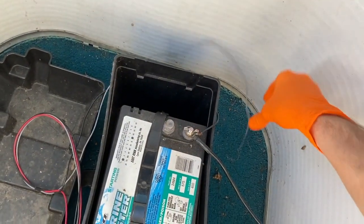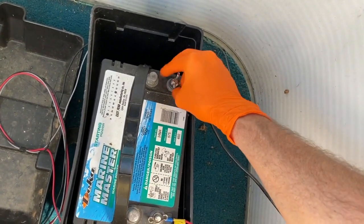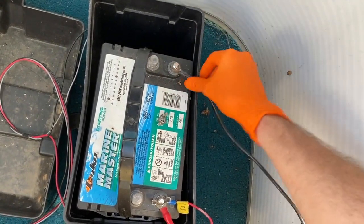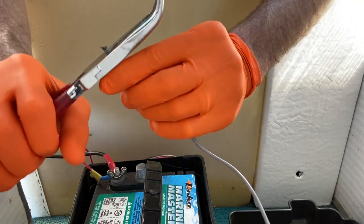One of the very first things we will do is cut all electrical power to the boat and remove everything from the negative terminal first. Then I want to cut any old portion of the wire away — maybe about a half an inch — and start fresh.